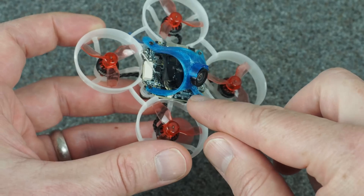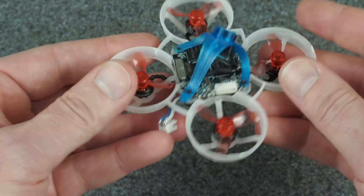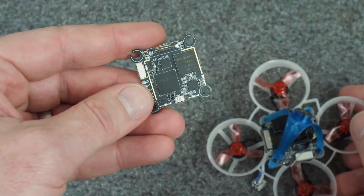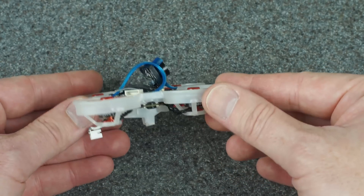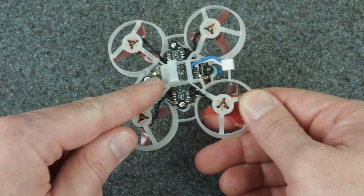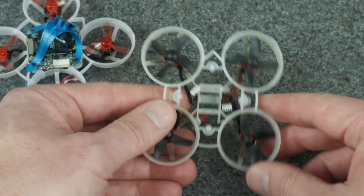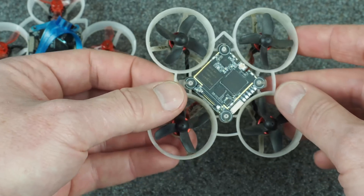When I made my 1S build, I wanted a super low profile look — as much like a regular 1S as possible — so I mounted the video transmitter where the flight controller would normally go, with the flight controller on the bottom. I had to cut away some material on the hoops to make the prototype VTX fit, but not so with the final version. The frame I used is the Beta 65 Pro version 3. If I put the VTX in now, you can see it fits perfectly with no modification to the frame.